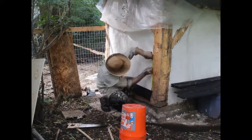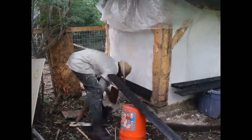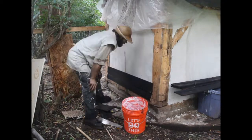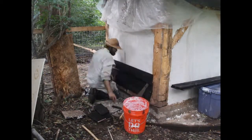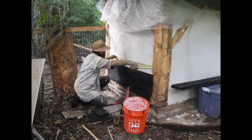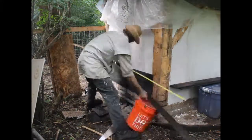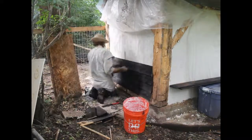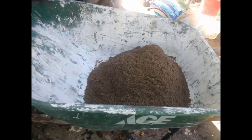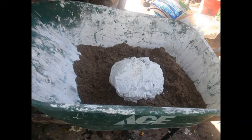To attach them I simply cut the boards and applied them like siding on a house. The original wood was cedar, so it was already somewhat weather resistant. I put the more carbonized ones near the bottom and the less carbonized ones near the top. Eventually all the exposed exterior wood would get a coat of linseed oil to help preserve it and keep moisture from penetrating.